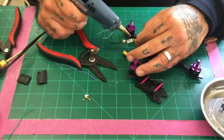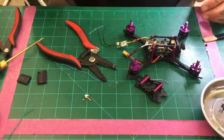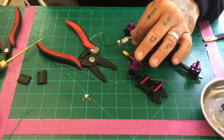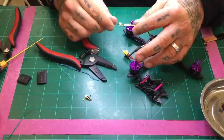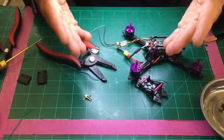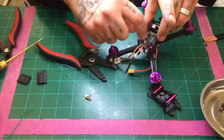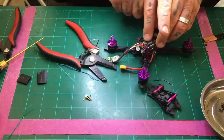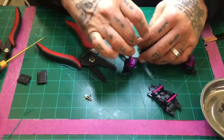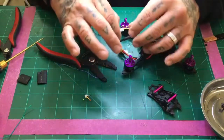All right, what'll happen though, and I've discussed this in the past, is you will see the glue that I'm applying. Once you put your heat shrink back on there, it's going to actually melt the glue back and almost bind that heat shrink and almost somewhat seal it off, so to speak. I'm also, for the customer, going to glue a little bit here, because these antennas can pop off, and I want to make sure that stays in place. But I'll do that at the last minute once I make sure everything here is done properly.